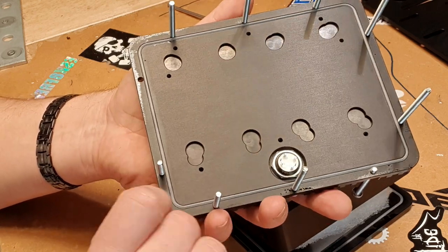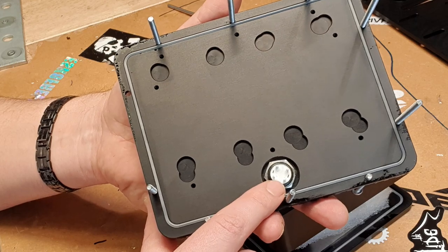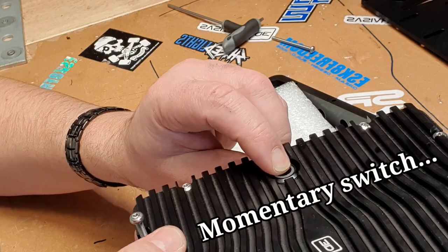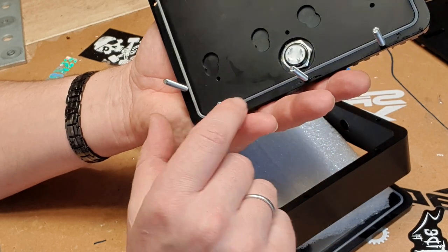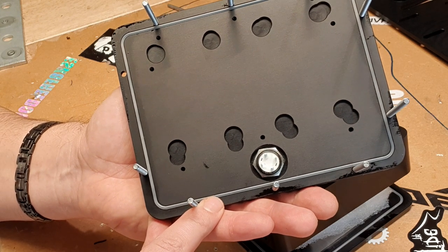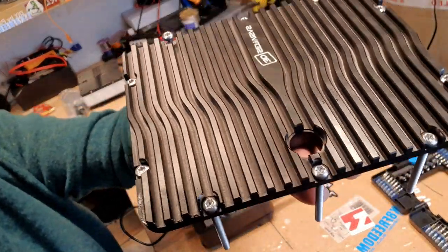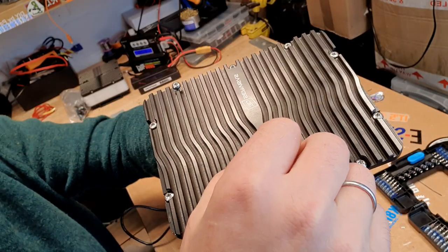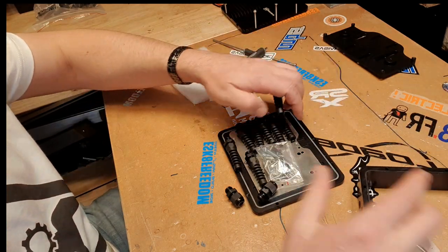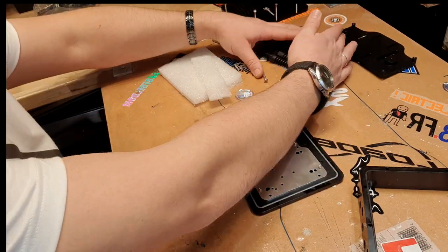While we're talking about the switch — this switch is provided so you can use it in-line with, let's say, a Unity or any other ESC that fits an instantaneous switch configuration. However, if required you can undo the nut and replace the switch for whichever one you need. The pre-drilled hole is 16 millimeters, so you can install any button you want. The seat for the washer is perfectly made. As described, you get everything required to install the ESCs or VESCs inside the enclosure.